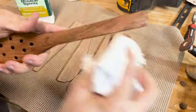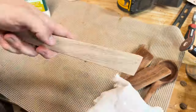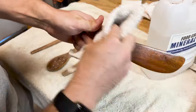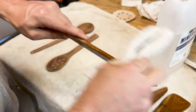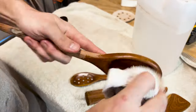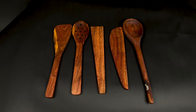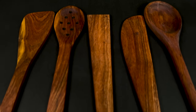After I finish up sanding, I take some mineral spirits to clear off any sawdust on the piece and also see if I missed any spots while sanding. After it's dried, I grab my mineral oil and make sure to coat each piece thoroughly. I came back periodically throughout the day and applied another coat until the pieces wouldn't accept any more. And this was the finished project — I think they turned out great, and I really love the color of mesquite being that kind of deep brown amber. These are for sale on my Etsy, which is linked below. In total I have about seven hours into them, which is not too bad for some firewood.